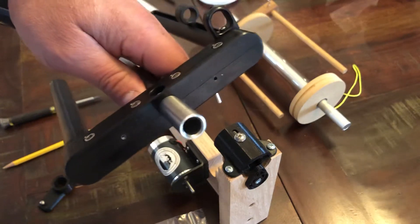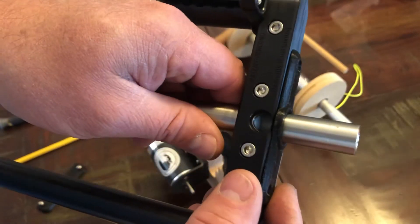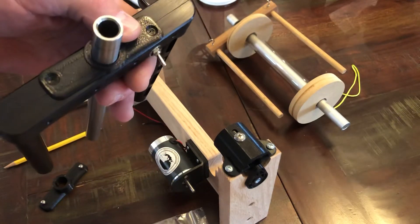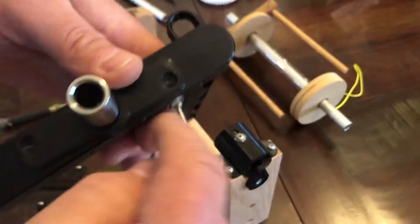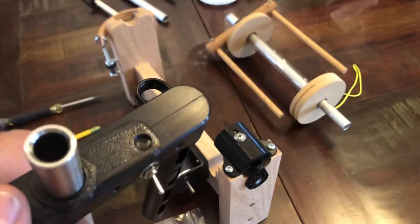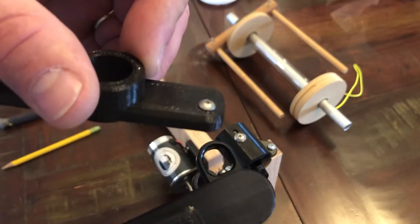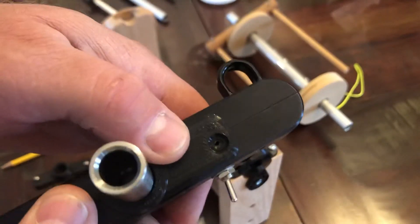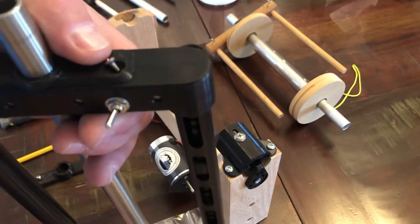Now I've taken that piece off. What I'm going to do is put the new slimmer spacer on. We have two screws here that have to be used with this spacer. The reason is that this is a countersunk hole, whereas the old unit used truss head screws and they're not countersunk. The reason we have to do that here is because the thickness of the spacer is pretty thin and we need to make sure we have plenty of force on the screws to hold them in.